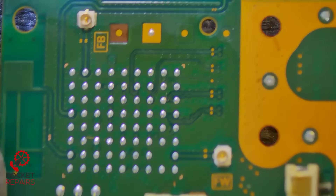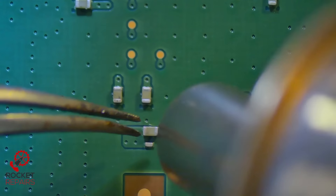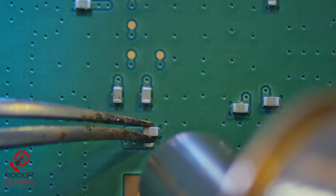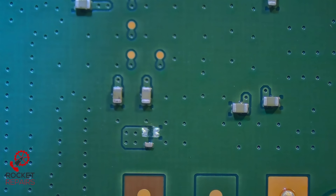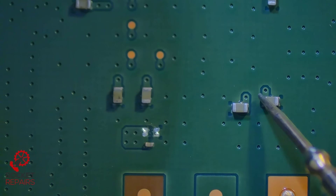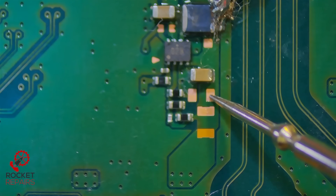I'm going to inject voltage again to see if it's still coming from the same area or if it's different now. Let's go ahead and remove this cap. Hopefully I recorded that — it's this capacitor that is the faulty one. Let's remove it and see what happens. It could also be the smaller one. Ground this side — do we have a short here? No, we don't. And the shorts on all the other caps have now gone. Do we have a short here? No — no more short. Our short has now gone.